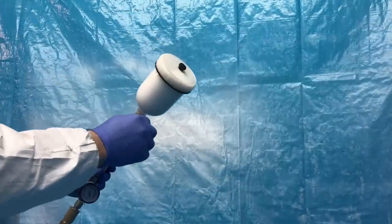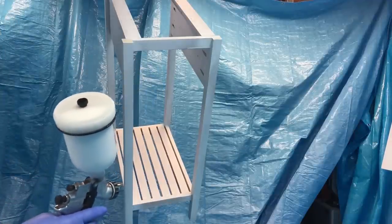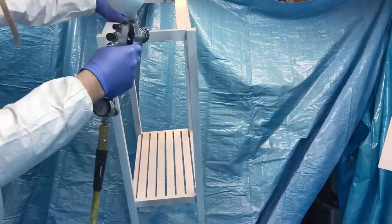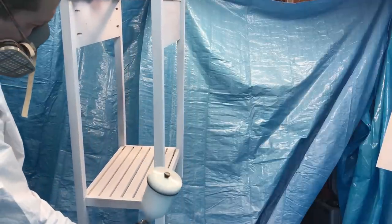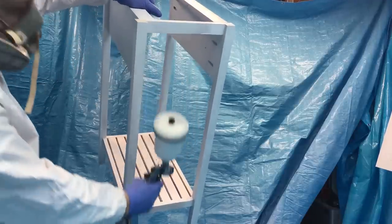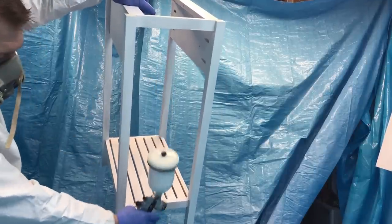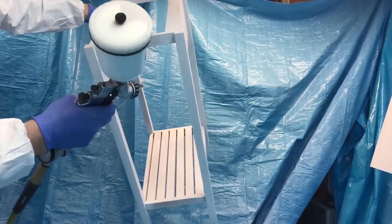With my gun adjusted, I'm now going to go to the project. You always want to find a spot no one's going to see where you can maneuver it around. When you spray, you start above the project, spray as you come down, and then finish below it. The reason is that if you reverse direction without passing the end, you'd put a double coat in one spot. So from here we just finish spraying the project.